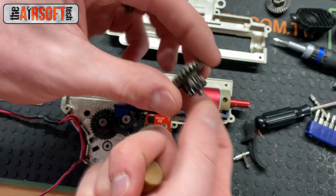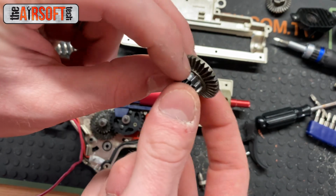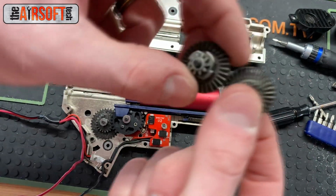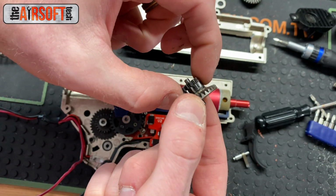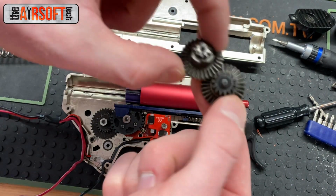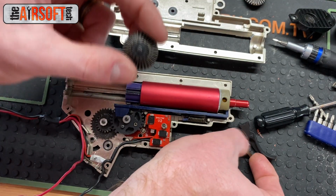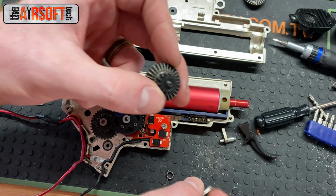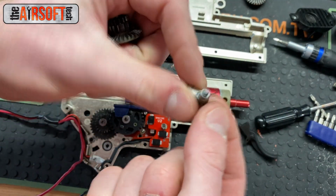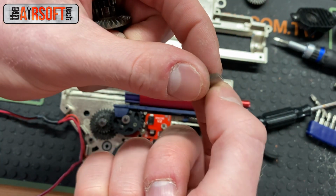So this is a Siegetek 10-to-1 bevel like I showed previously. And you can see it's got a lot more latches on it, and the latches are at a different type of angle, and the bevel gear is kind of pushed out a little further here. So clearly our regular anti-reversal latch isn't going to work. It won't quite catch right, and so you have to basically square off the end like so. And you don't have to do a whole lot.